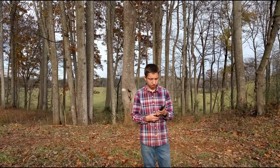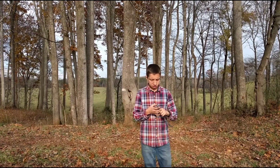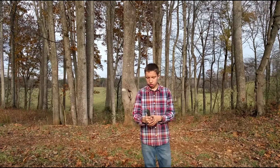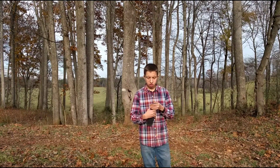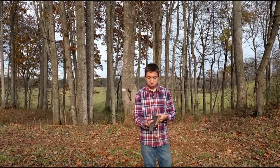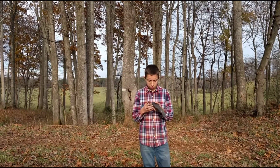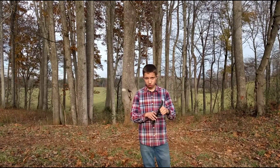Guys, I learned something on how to make this wonderful adze here. It's nice and sharp, and I'll be making a handle for this. I'm not sure if I'm going to make a video. Might. But yeah, it turned out good. Heat treat went well and took an edge. This was made out of a lawnmower blade.